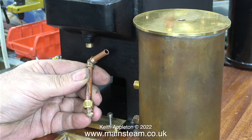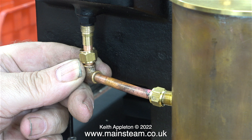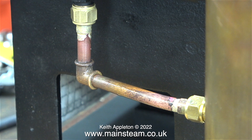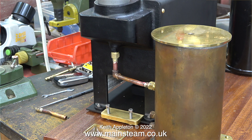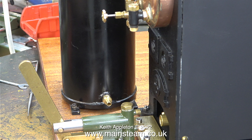I screwed the first piece of copper tubing into the elbow by putting it in the chuck to hold it while I did the job. The chuck is better than a pair of pliers because it doesn't mark the work. I managed to screw in both pieces of copper tubing all the way into the elbow, then I silver soldered a union cone onto the other end. It took two attempts to get everything to line up, but I did it by eye. That's the exhaust steam to the chimney piped.